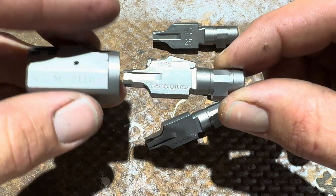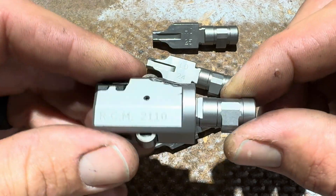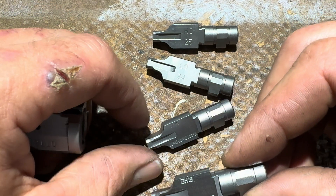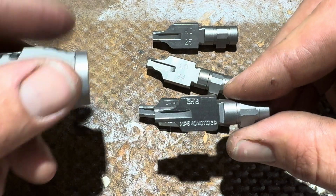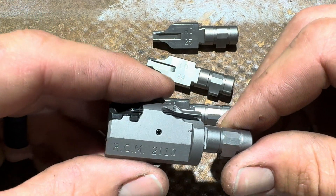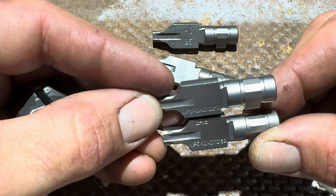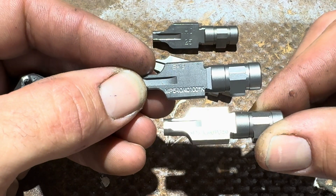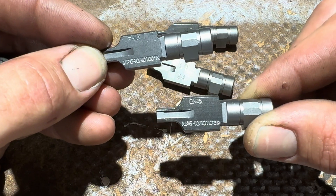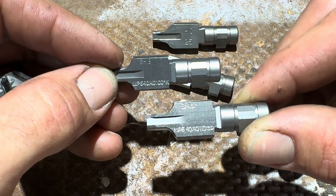As soon as you pass a port or a vent, or the projectile leaves the chamber, it basically needs to be well underway in unlocking and extracting the cartridge from the chamber. This is something I understood intrinsically but didn't fully get until I ran into a problem with a reverse-stretch 10 millimeter I'm putting together. I always figured a suppressor would make a difference - looking at the SD having a steeper angle than the K, you'd think because the SD is suppressed, there's residual energy in the suppressor that would help unlocking. But it doesn't matter because the barrel's ported, so you have to run a very steep angle locking piece when you have a short or short ported barrel.